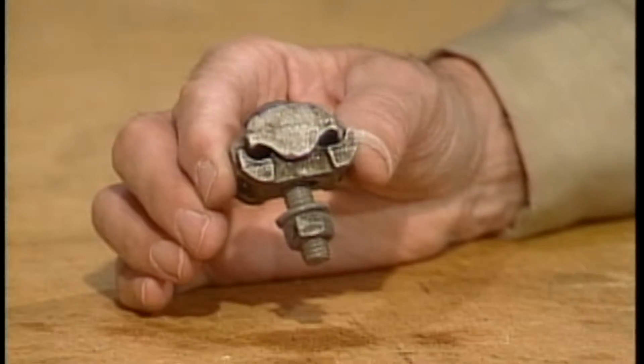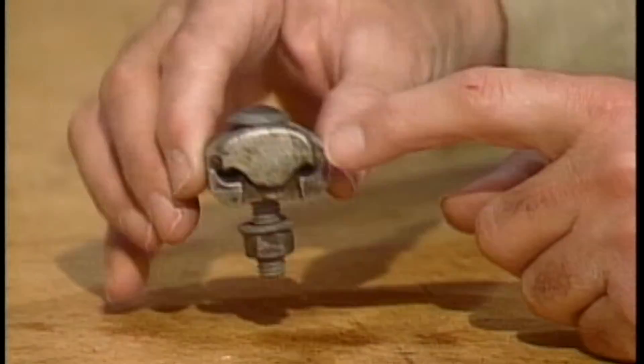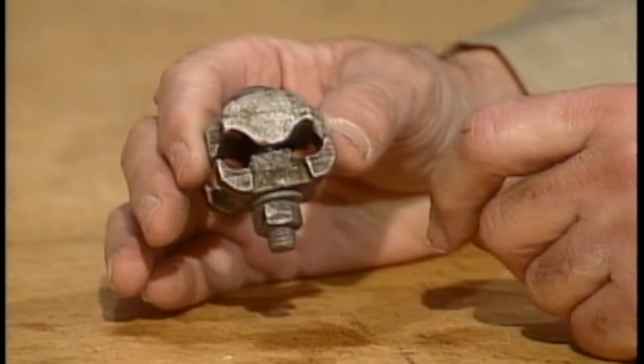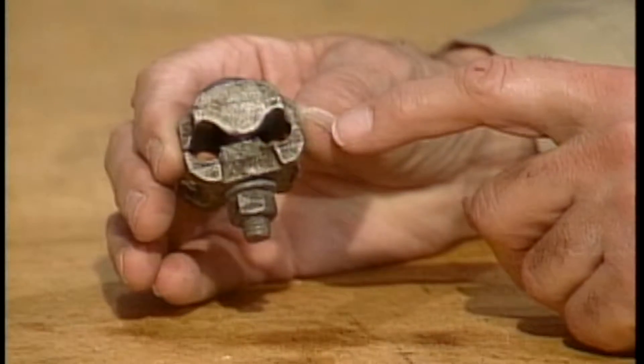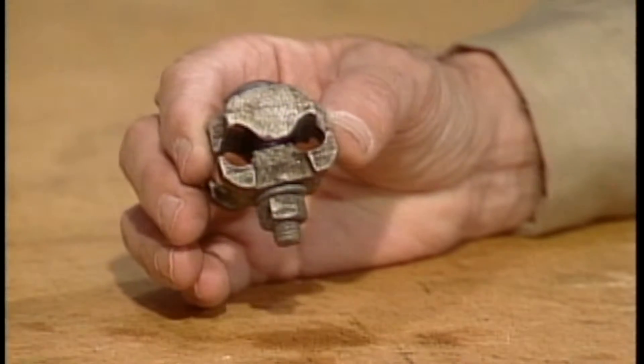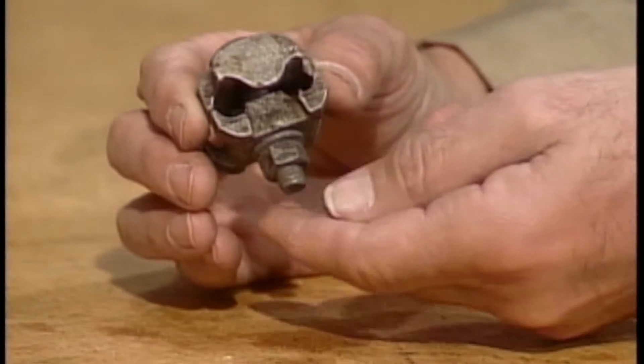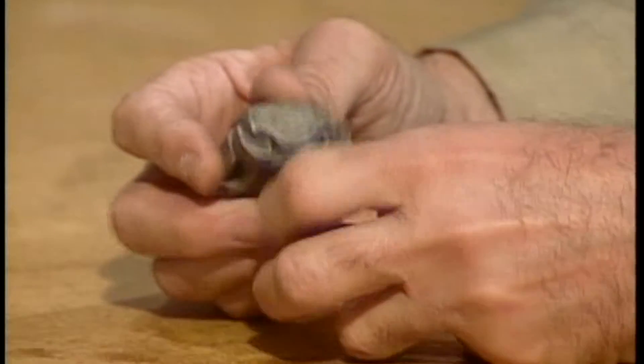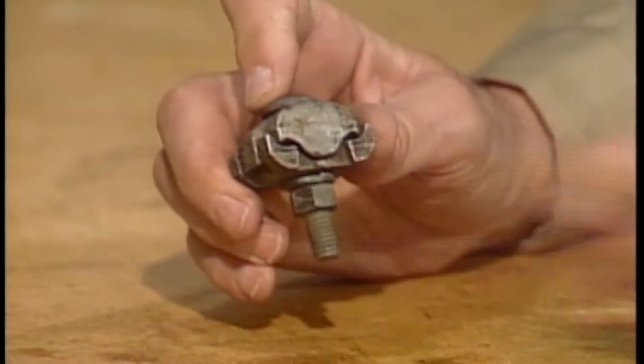Here's another mechanical connector. This one is a single bolt, parallel groove connector. It has a single-threaded bolt that fits through two plates. The wires that are to be connected together are placed between the plates on opposite sides of the bolt. A nut is threaded onto the bolt and tightened down to force the plates together, securing the wires and making a firm mechanical and electrical connection.